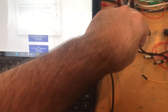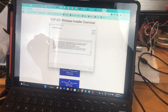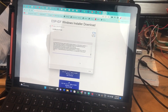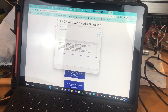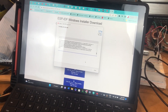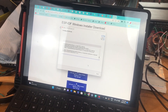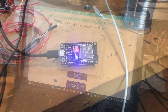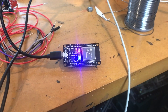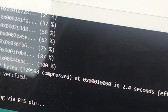More adventures along the way. The cable I was originally using wasn't actually communicating with the microcontroller — it was a charging-only cable. You've got to be very careful to use the right data cable. I was also having driver issues, so I loaded up the necessary drivers, and after that we got a blue LED flashing at one-second intervals and a successful upload.